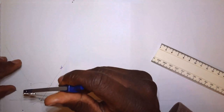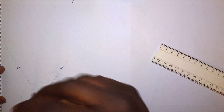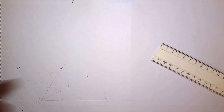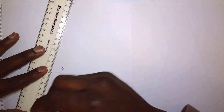Let's call this point C. I'm going to stand at a, open more than half the distance of the arc, scribe an arc. Stand at C, same distance, scribe to cut the former. Where those two lines cut, let's call that D. I'm going to draw a phantom line from A through D — and that's our phantom 45 degree line.